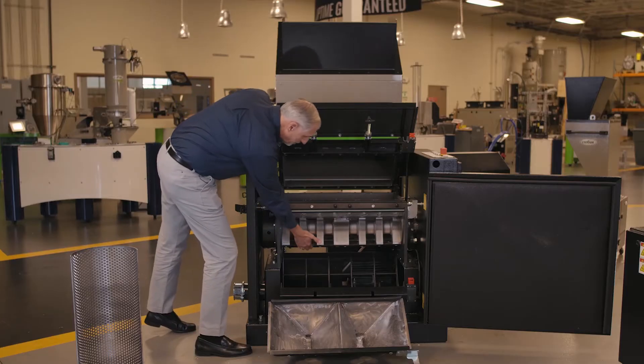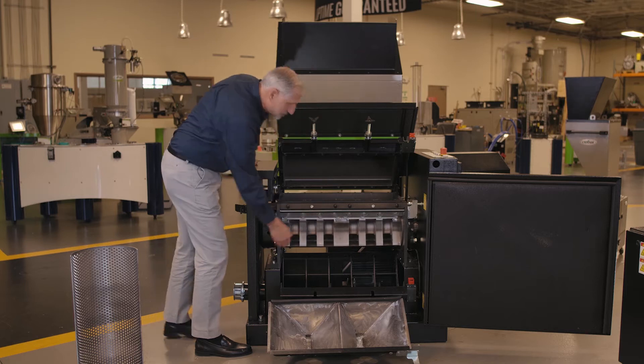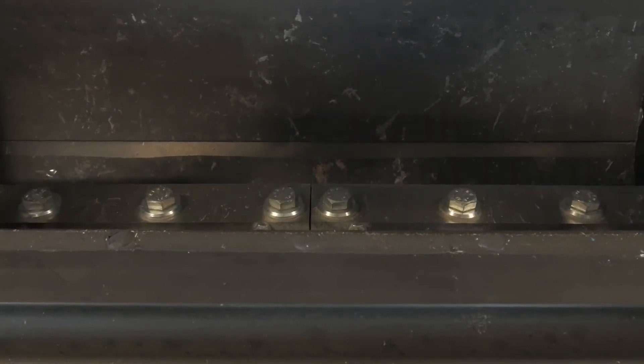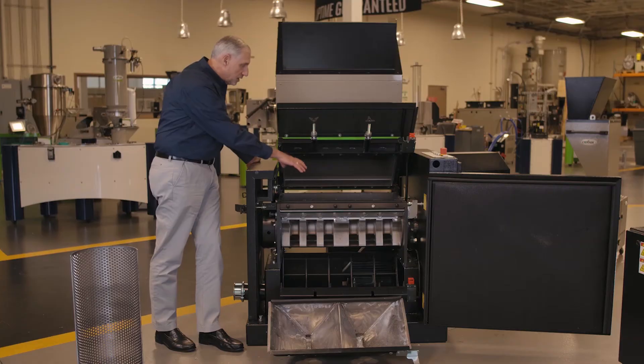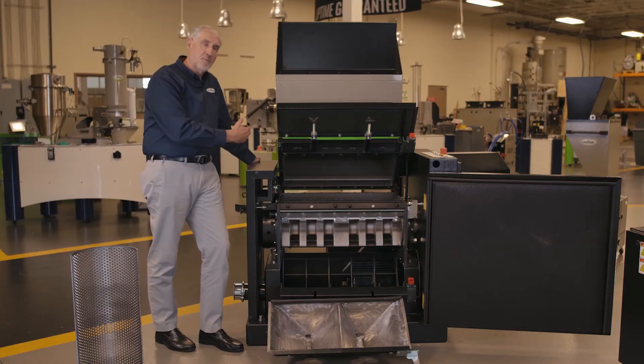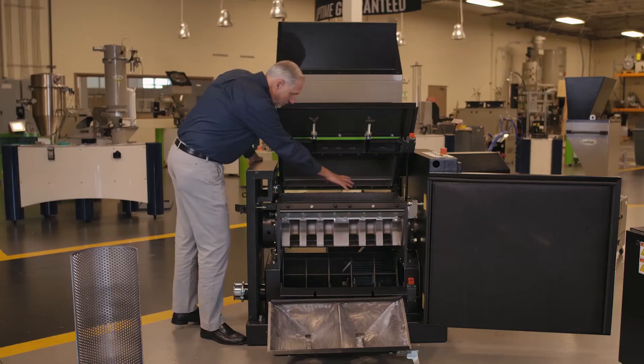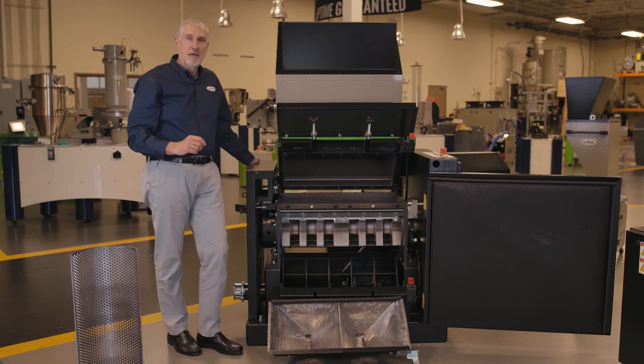The rotor itself is a three-blade rotor, which is standard in this machine. No cast components — all welded steel with a highly polished cutting chamber. There are two types of cutting chamber geometries: super tangential and tangential. This one is a super tangential, designed more for bulky type parts. The chamber itself has a hardening process called nitox — a special hardened process that is standard on all Vipers from the 6 series all the way up to the 17 series.